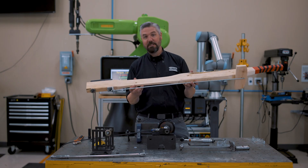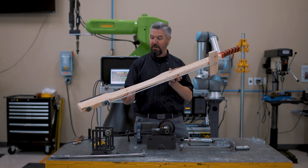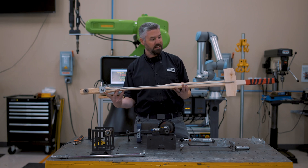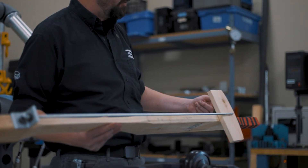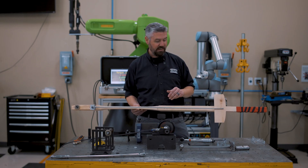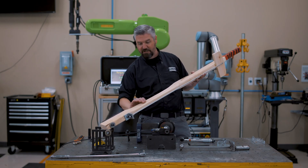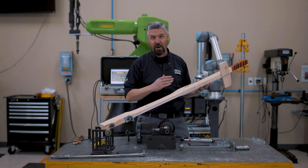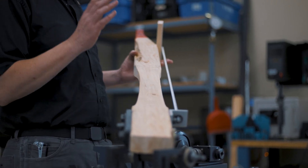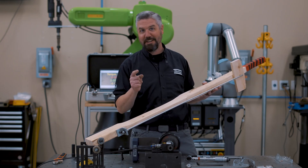Back to basics — we've constructed the deflecting beam 2x4 torque wrench. We've got a half-inch square drive on this side and a mount for our indicating bar. The only thing left to do is put the marks on here to the right torque values, which we'll do through a calibration process. We really had to thin down this section in order to get the resolution of bending I wanted for accuracy. We've limited the overall torque capacity — I was targeting 100 foot-pounds, which is the torque the wheels on my car take to install.